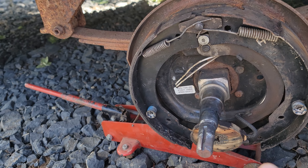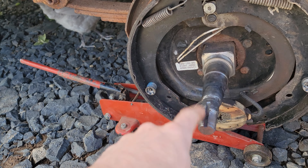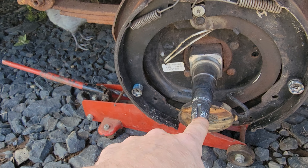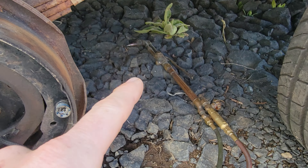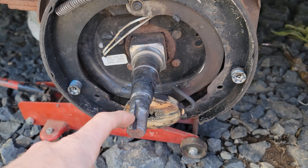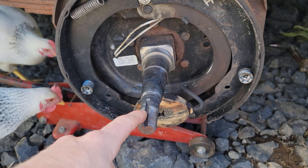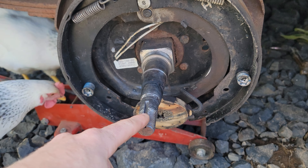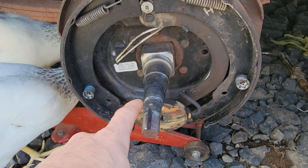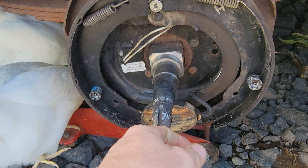that this section of the spindle got bent up, and I actually bent it backwards that direction a little bit too. So last night I heated this up with the oxy-acetylene torch and bent it back, then I heated it up again to 1300 degrees and sprayed it with the garden hose and cooled it down real fast to harden it.